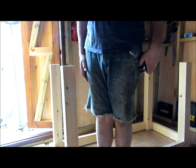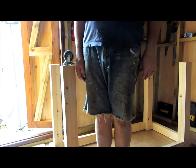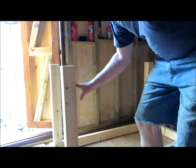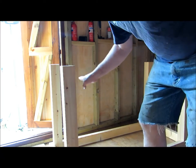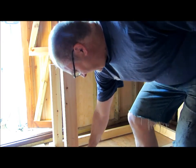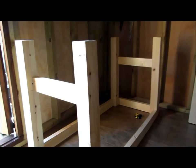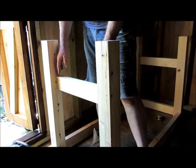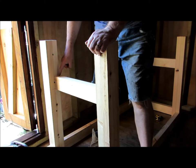If it's too high you can always cut it lower - it's a bit more awkward to add height. You may think that's not quite the height I said - that's better. Because the height may be adjusted, I'm not going to measure the height of the shelf from the floor. Remember it's upside down - I'm not measuring from the floor because this might not quite be level; I'm going to measure the height downwards from the top to where I want it. What I've done here is some toenail joints.